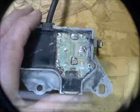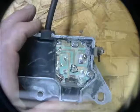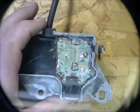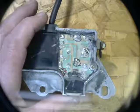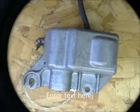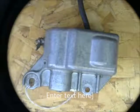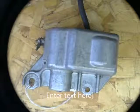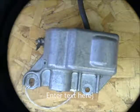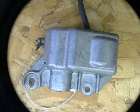Since the capacitor is good, I'm going to reconnect it to the circuit. I've already jumpered across the connections that I inadvertently separated earlier, so we're just going to reconnect the capacitor and run it on the engine simulator to get some more clues. When I ran the unit on the engine simulator, the unit worked just fine — it put out a continuous string of sparks. So in summary, the problem was a cold solder joint. I fixed the cold solder joint, retested it, and it works. This has been returned to service to be put back on a Miller Bluestar 2E welder.